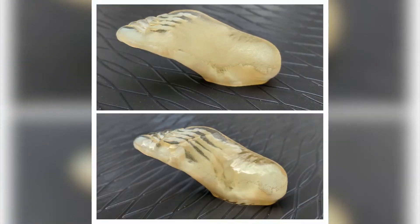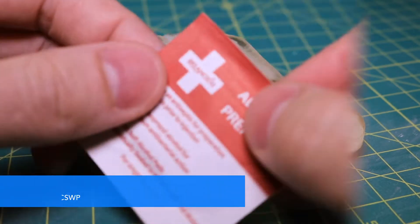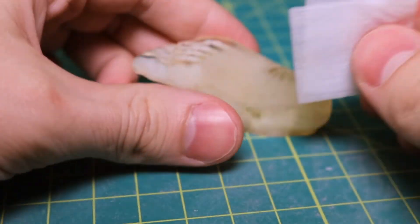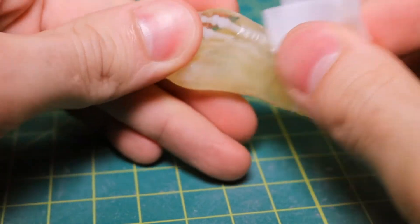In this video we are going to talk about how to post-process PolyJet 3D printed parts to achieve a more transparent and uniform surface. The first step after removing the support material is to use an alcohol prep pad to fully wipe down the model. This will help clean the model and prepare the surface to fully bond with the transparent clear coat.